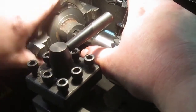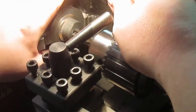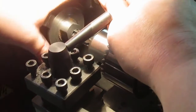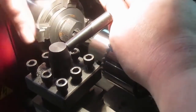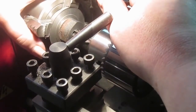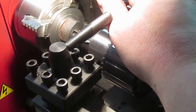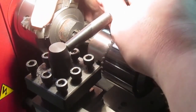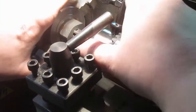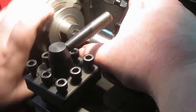And if I didn't mention it before, this is half inch BSB, British Standard Brass, which is a 26 TPI thread. It's quite fine. And it's chosen partially because it's on the plan, which is always a good reason, but also because the tapping drill is slightly larger than the seat for the O-ring, so the O-ring can pass through without tearing itself apart on the thread, which is only a problem when it's actually going in and coming out, I suppose, though if it's coming out, it's probably getting replaced, it isn't really an issue.